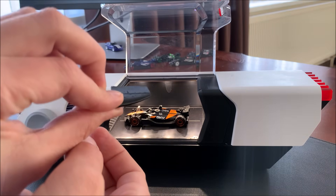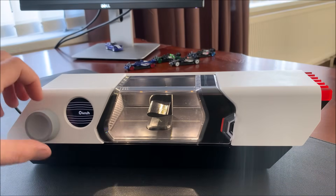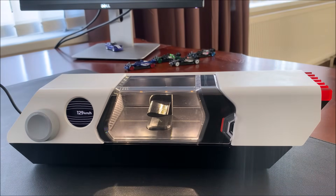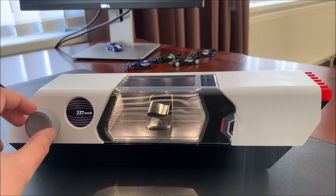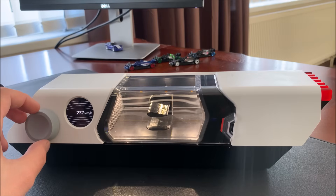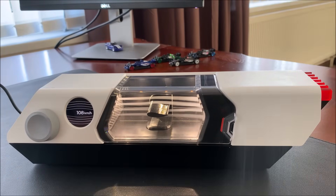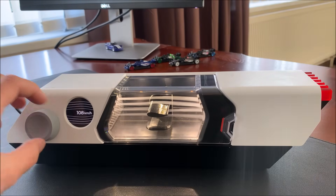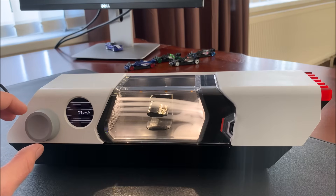Let's see how these wings perform. We can see how the streamlines are building up now. We can increase the speed and you can see there are some separations behind that — it's not a super clean flow and the surface below isn't perfect either. But around 100 kilometers per hour indicated here we can see quite a nice flow. If we reduce the speed we get a lot of thick streamlines so we can see pretty nicely what's happening.